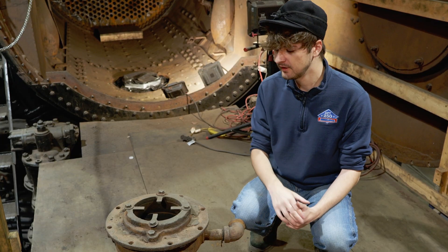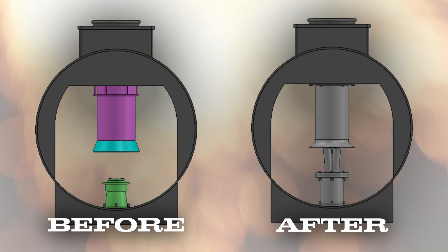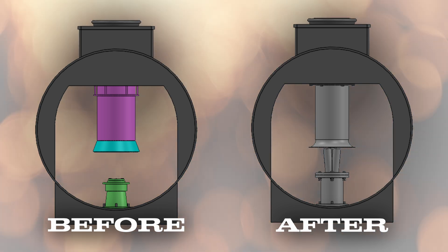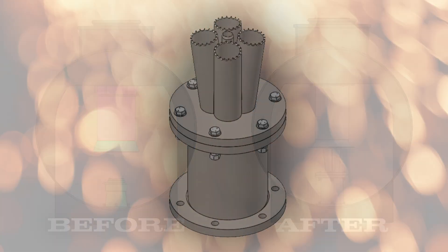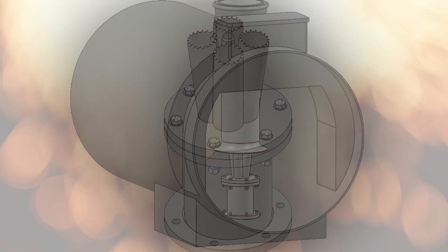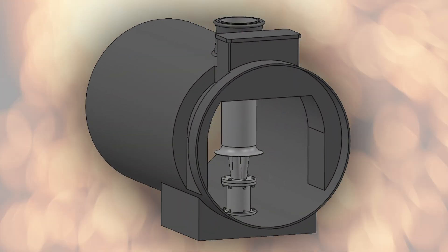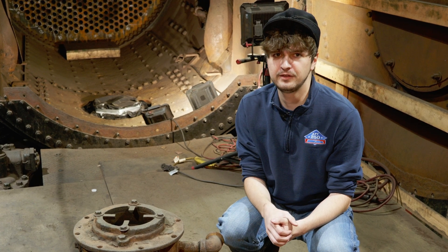With that being said, however, we're pleased to say that FMW Solutions has completed engineering on the blast nozzle and petticoat arrangement. The locomotive will have a beautiful LEMPOR exhaust with multiple nozzles, the petticoat will have a curvature shape to it, and the distance between those two components will be shortened up pretty considerably. Make sure to stay tuned for a big video from FMW Solutions coming soon, going over all the technical aspects of this oil conversion.